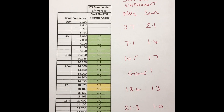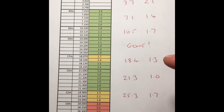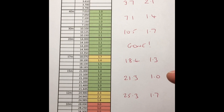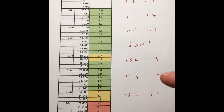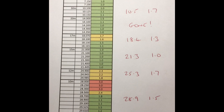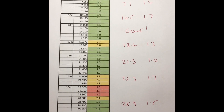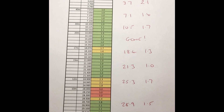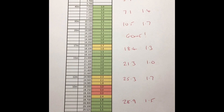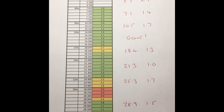20 meters had gone completely. Moving down the band, we've got 17, 15 meters which is fine - always very low. Then 12 and 10, tuned for the bottom end of the band, and 6 meters. So this experiment I went a bit off-spec and added 80 without adjusting anything else on the antenna.